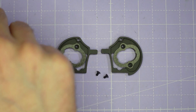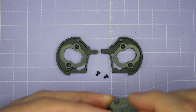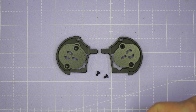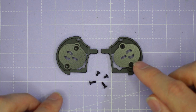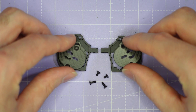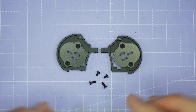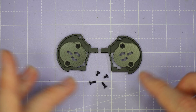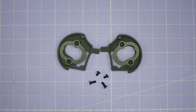If you want to hard mount your camera instead and you've got a 19mm camera, you're going to take the two hard mount plates and place them on top of the soft mount plates in the camera cage, again with the countersink facing upwards, then attach those plates through the stack with a slightly longer M2 by 6mm countersunk screw. These hard mount plates can be orientated with the two slots facing forward or alternatively with the two slots facing backwards, depending on the type of camera you're mounting. I'm going to be building this for the O3 system, so I'll be using the soft mount camera plates and the silicone gummies provided in the kit.